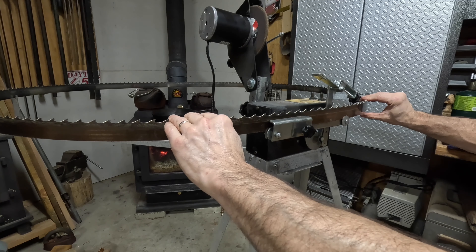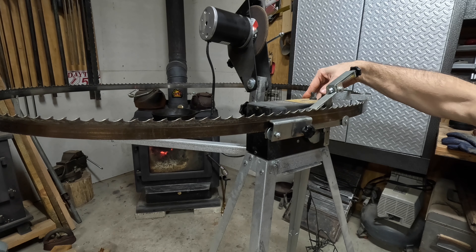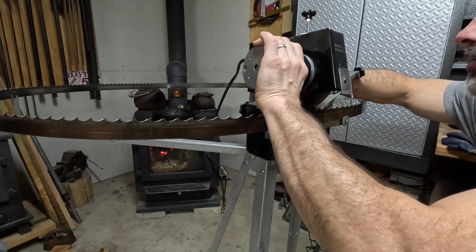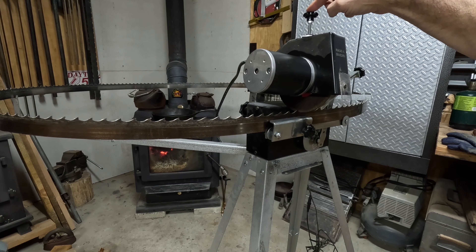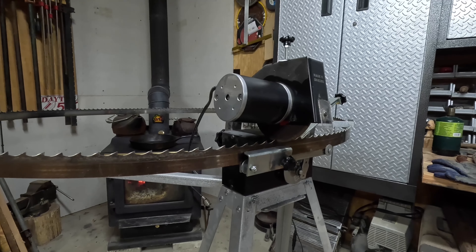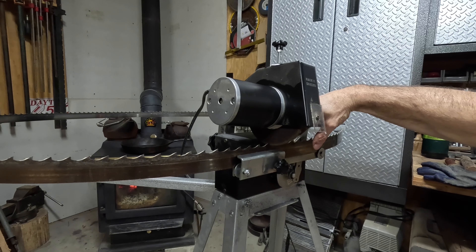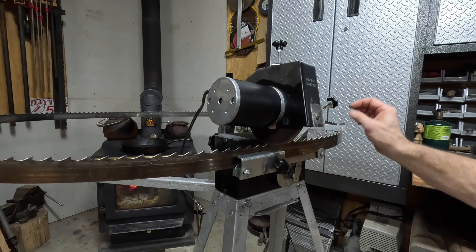When I get started, I bring the blade back a little bit, I put the drive mechanism in place, and I turn it on. I bring the grind unit down, set the stem piece — the stem that sets the height of your grinding wheel in its index spot. I do not turn on the grinding wheel; I just turn on the drive.